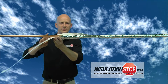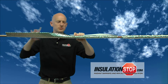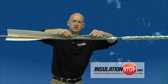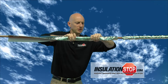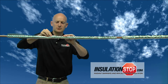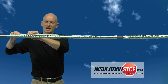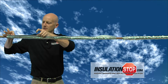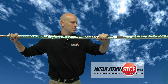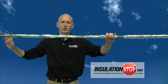It's good to tack down the end, and I like to work in manageable lengths — this is probably three and a half feet. This also gives you an R4 thermal rating for wrapping your pipes. It doesn't have to be perfect, folks, as long as you make a good seam and the entire pipe is wrapped. And that is the linear pipe wrap, sold in six inch widths.